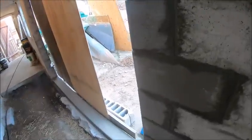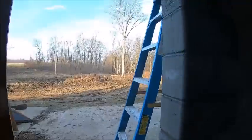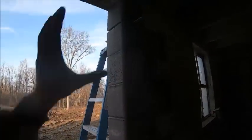Okay, so this is why I needed these blocks all nice and, well, they're not dry, but I needed these blocks firm. So I got that block in there and I got shim shingles wedged under it, drove in nice and tight so that it's wedged up against the barn beam. I needed to be able to do that without pushing down and smashing mortar joints on any of these. So that one's set, it's ready to go. I can go ahead and tuck it in.